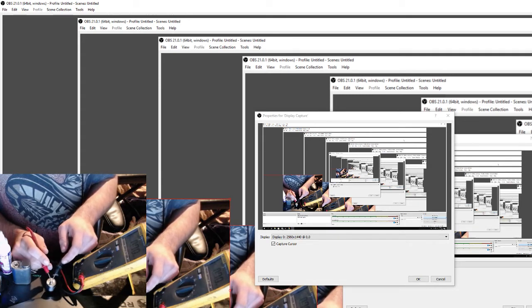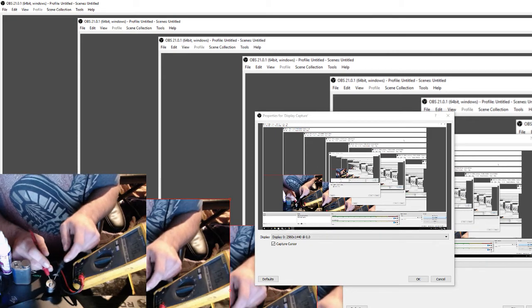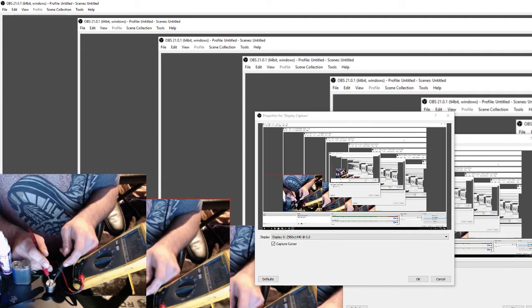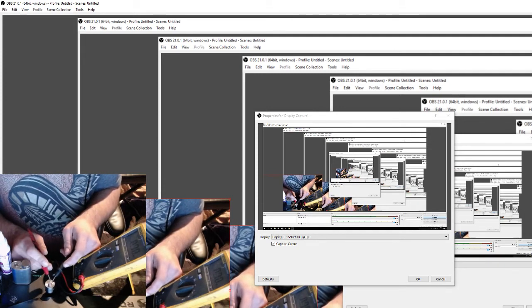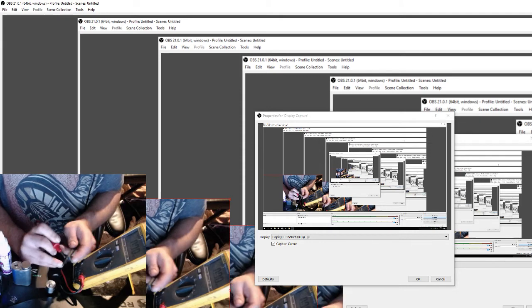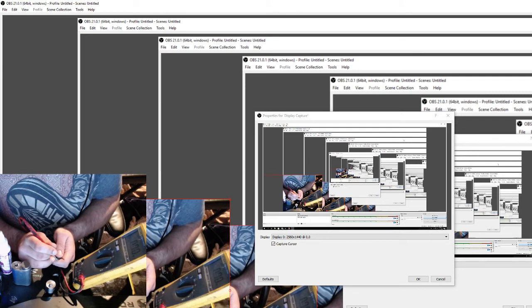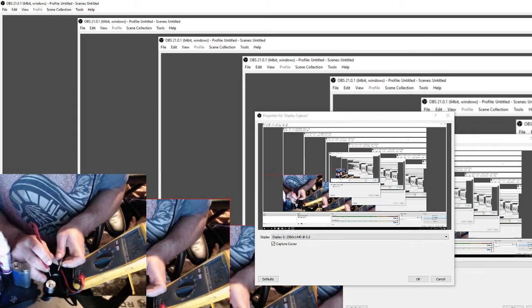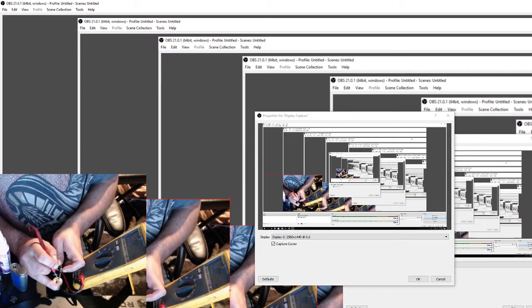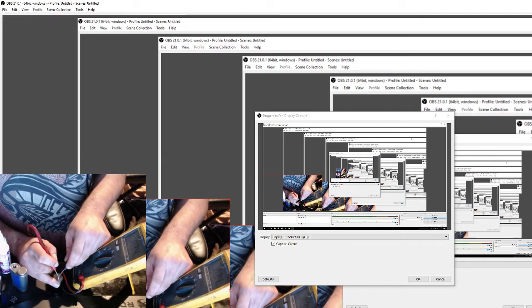Now, what I'm going to do is touch both of these prods at the same time, and hold it there until the screen registers zero. And why am I going to do this? I'm going to do this because by default, the multimeter is not calibrated. It should be calibrated every time. So if I were to put this on right now, it's showing 0.1. It's going to show a resistance that is 1 deci-ohm higher than the actual resistance.